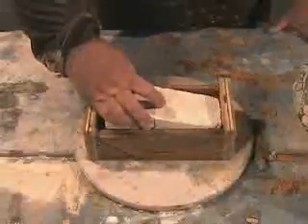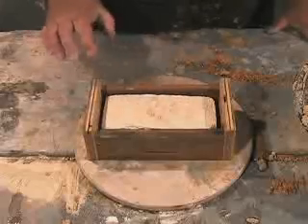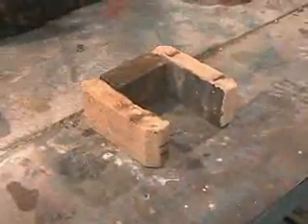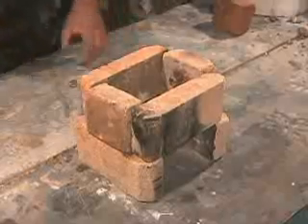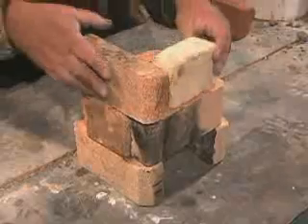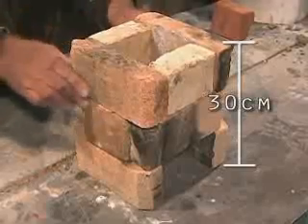Here is the fired brick. It has reduced in size as it was dried and fired. After a bit of experimentation, lightweight, durable bricks can be easily made. The combustion chamber is made with one shorter heavy brick in the back, which resists abrasion from the sticks of wood being pushed into it. The other bricks are placed around the heavy brick in back. Three courses of brick make the combustion chamber. This creates an insulated space above the fire to help the smoke, air, and fire mix together so that the smoke is burnt up and the pollution harmful to human health is decreased.